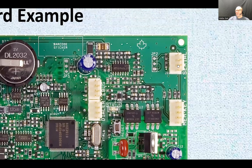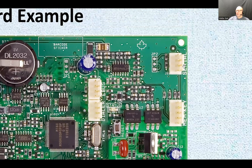All right, here is one that you're probably going to use a lot. Here is the serial port. Now, for the most part, there are two main reasons for this to be used, and one of them is to connect with your laptop if you want to do a direct cable connection onto this board. For your laptop, you would need something called a serial port interface, because laptops used to have serial ports. Very rarely you can see a serial port incorporated into the motherboard of a laptop, but you have something like a little box, about this size, that is called a serial interface. On one end, it has a USB cable, so you can plug it into the USB port of your laptop, and on the other side, it has a 9-pin serial port interface, and then you get a specially made, proprietary cable for this. Plug it in, and you can connect to this whole board with your laptop.